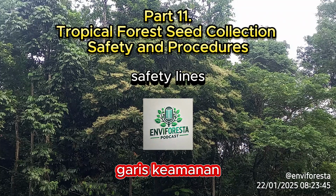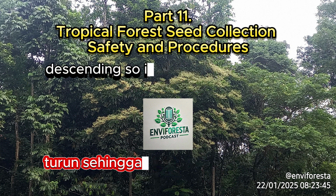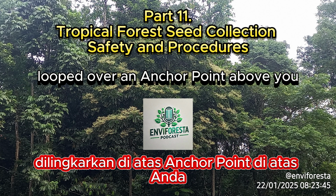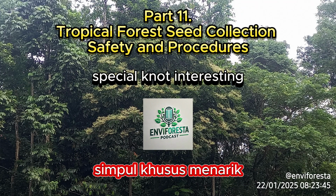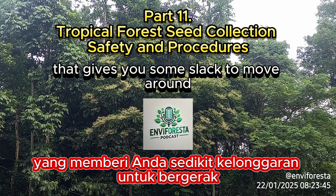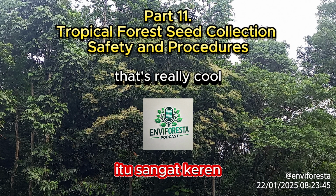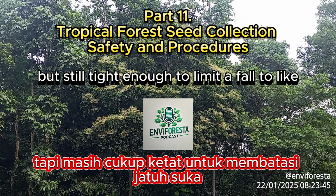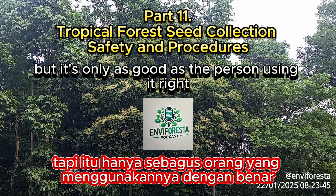Exactly. Now, safety lines are for ascending, moving horizontally, and descending. It's connected to your harness, looped over an anchor point above you, and then attached back to you with a prusik loop. It's a special knot that gives you some slack to move around, but if you fall, it catches you. You have to adjust it so it's not in the way, but still tight enough to limit a fall to just a couple of meters. So it's a pretty dynamic system. Yes, but it's only as good as the person using it.